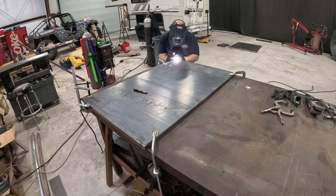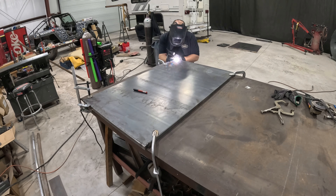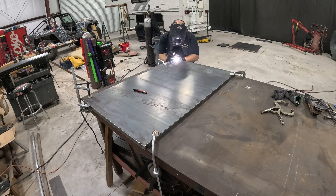The driver's side rear door is all pretty much done — all welded. Next thing I'm going to do is put my latch in. I got these — I think they're pretty cool — they're lockable and the kind that just pop up and you can open. A nice little flush mount should look pretty good on there. I think I decided to go ahead and do a series of spot welds for the hinge instead of rivets or screws. If it has to come off, I'll figure that out — another bridge to cross. We'll get the latch laid out on this door, do the other door, get the hinges put on, and then put them on the frame.